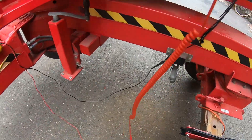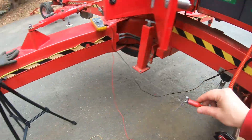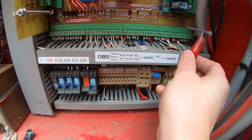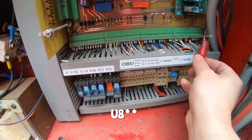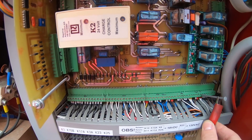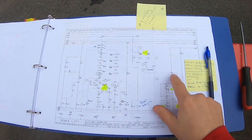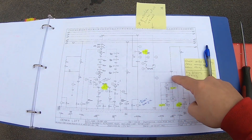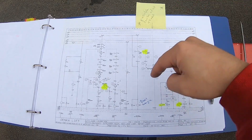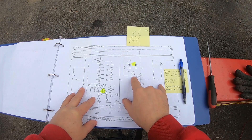So I've got this little jumper here and I'll put it on the positive bus — you can see I have positive and negative there. Watch what happens when I apply energy to K8 — we get all those relays working. So we have some sort of problem we need to solve. We proved that we don't have energy there, but if we put energy there we get all of these relays and all the functions work that didn't work before: boom down, telescope, and emergency lowering.